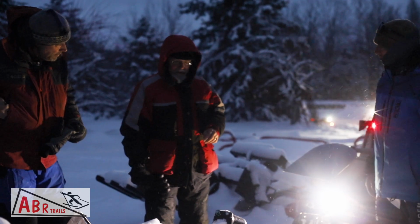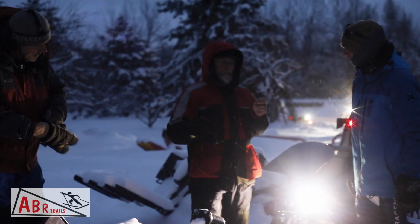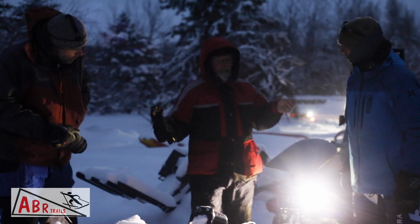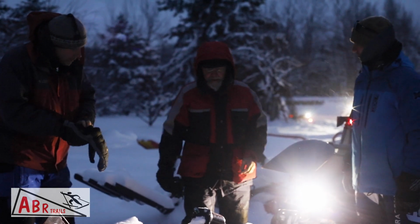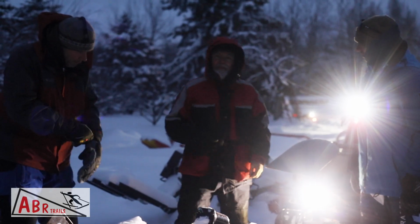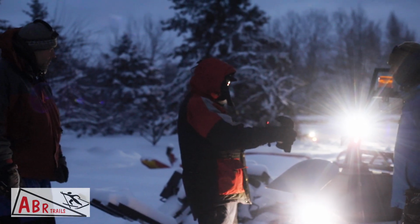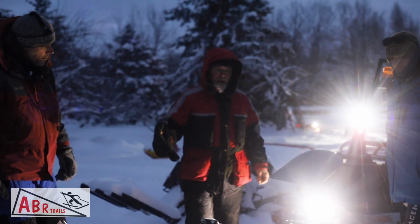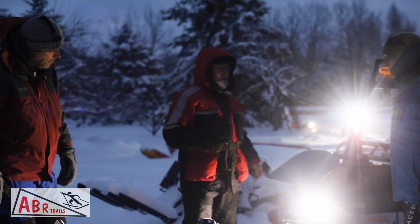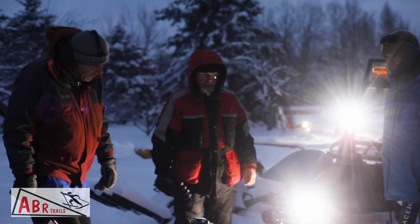Sometimes the Ginsus have a problem flowing snow through, even with the teeth all the way up. If it's balling up with snow and pushing it out the sides, we never want to lose snow off the sides of the trail if we can help it, because you never know when the snow is going to quit. So if you've got weights on and it's not flowing, you can stop and, if you have to, dump them off out in the woods somewhere. Usually with the Arctic Cats, you can put one weight on each running board. The sled won't know the difference if you have to take them off. That's what I do. I only had to do it once or twice. Put them in the box. But if you have to leave them out in the woods, make a mental note or put a stick through them so you can pick them up at a later date, if she's pulling so hard that you have to take them off.